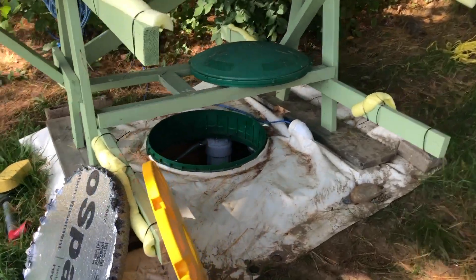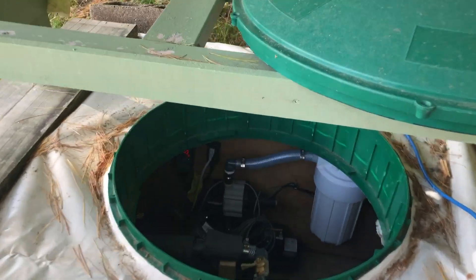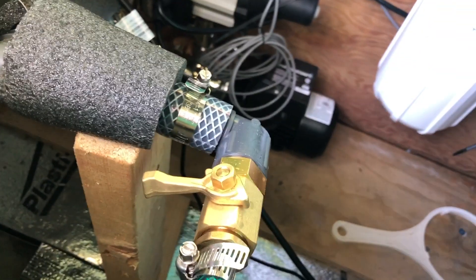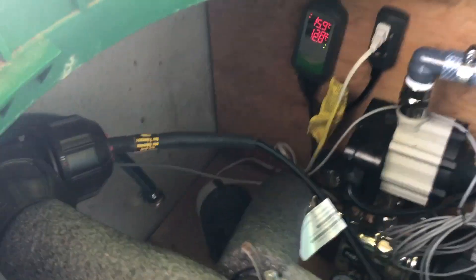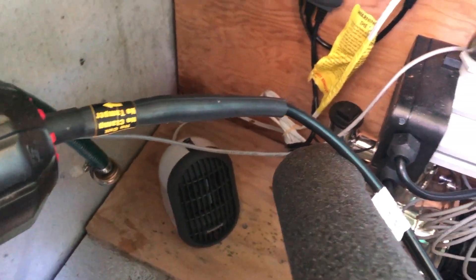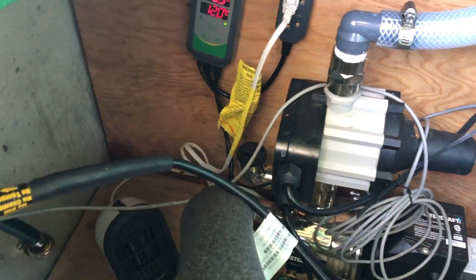What's happening inside our boat rack is that the boat rack is sitting on top of a precast concrete pump chamber. The water line is heat-traced from the lake to this point. It comes in here and we've got a priming line if we have to prime this pump with a garden hose — we've only had to do that once. There's an Inkbird thermostat that controls a little heater down there. That's so that the pump chamber, whenever it senses it's dropped down to 10 Celsius, will fire on and run that heater to warm up the pump chamber.